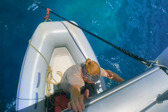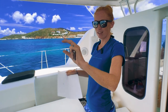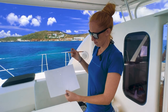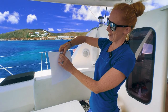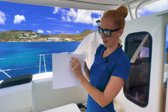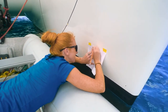The second I drilled the hole, a ferry came past and gave us massive swell. I think we're okay. We've got the primary teacher on it again — you can't go wrong with a paper template. I needed parallel lines, so we've got the waterline — the boot stripe — that goes along the bottom and we're just having to hope that is horizontal. I've measured up where I think the hole is and then used a not-very-straight ruler to try and measure the other two. So I'm going to put this on, put a bolt into the bottom hole that exists, and then I should be able to mark up these two. When we take the template away this should still match up to where the marks are. You didn't flip the template. Oh, good shout! I'm useful for something.